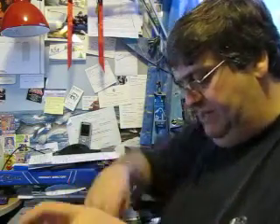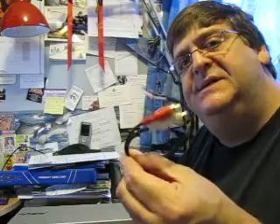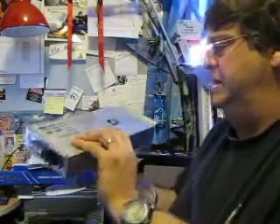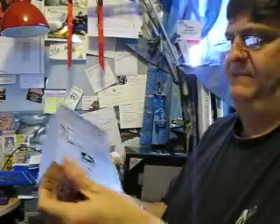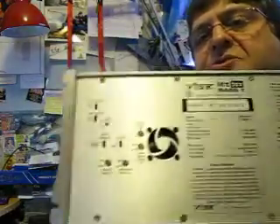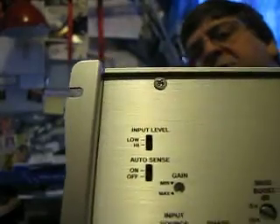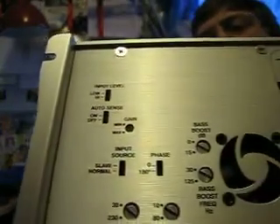You get all kinds of bits and bobs in here. It's auto-sensing, so you get a little speaker level to signal converter, so you can switch it underneath to auto-sensing. This beast is absolutely bristling with little controls, all hidden away. There's a fan aperture there, and if you look closely you can see the switches — phase, crossover point, auto-sensing, various stuff like that. And on the bottom of the amp as well, a whole bunch of stuff about the technologies they use and how they label them.